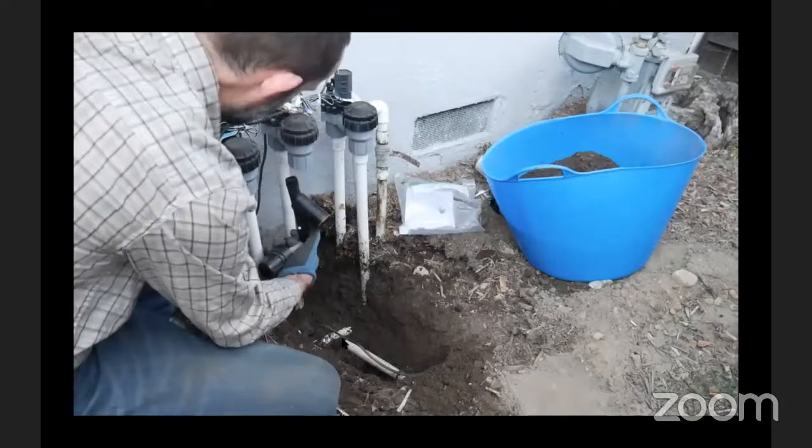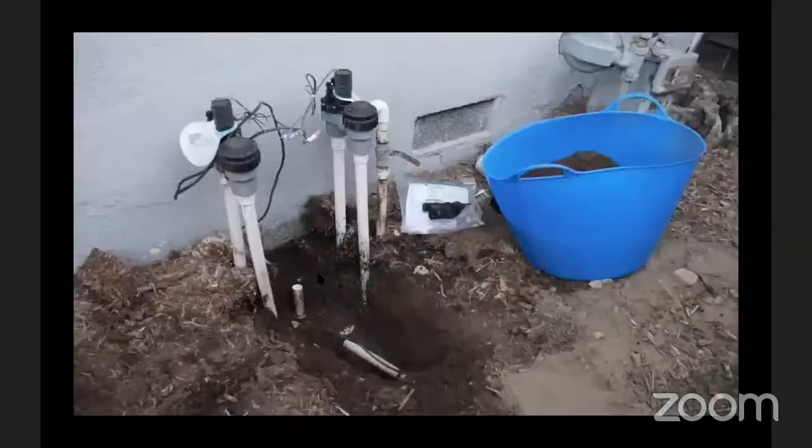Then here, if you are only going to be adding in this filter pressure reducer, you would screw that in here with some thread seal tape. One tip is when you screw these on, the way that they work is you need to take off the cap and the filter, and that makes it less long, which means you can actually screw it in. The piece is too long to screw all the way around. It'll be hitting this back part if you don't take that off.